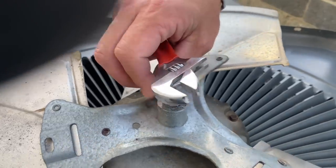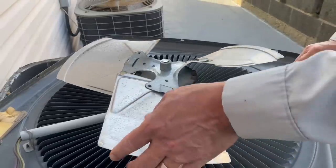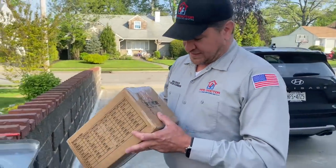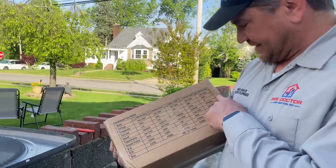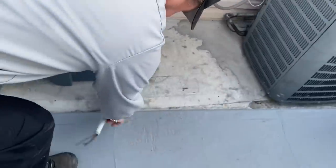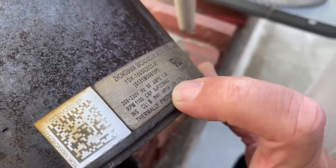You think it's going to come right out? It did last time. All right, oh baby — yeah, that's right! So for our replacement condenser fan motor, I got this sent by Vivor, they want me to try it out. This is a 208/230V, one amp, 1075 RPM. Let's take a look at the old motor for any identifying information. On this Goodman we have 1100 RPM, and we're at a quarter horsepower.